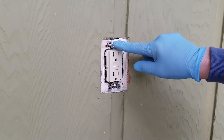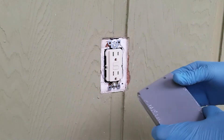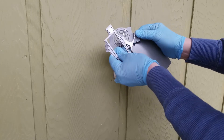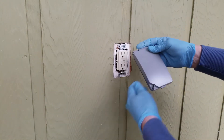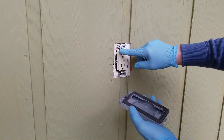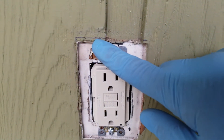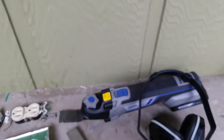The unit is installed. I didn't tighten the screws all the way down since I want a little flexibility when I put on the new cover and may need to adjust things. We'll have to see if this cover actually fits. The cover comes with a bunch of inserts — since I'm using the Decora style, one insert fits and the others can be tossed. The problem is the box is bigger than what was there originally, so I'll have to trim some material away using an oscillating saw — a Dremel multi-tool — wearing hearing protection.